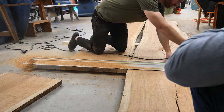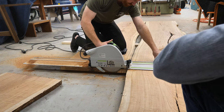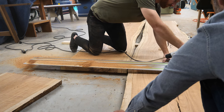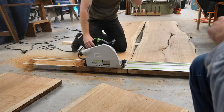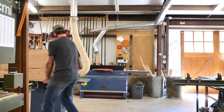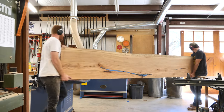These probably have some tension in them — they are big slabs. The way to get around that is to set half your depth of cut, cut halfway through the material, and then come back and cut the full pass. I want to mention that these came from Burdahl Sawmill — some really awesome slabs. This is some of the nicest pecan I've seen. It's got curly figure to it, really unique, super interesting stuff. Can't wait for you guys to see it finished. I wanted to give a shout out to Burdahl because they provide a really good product.